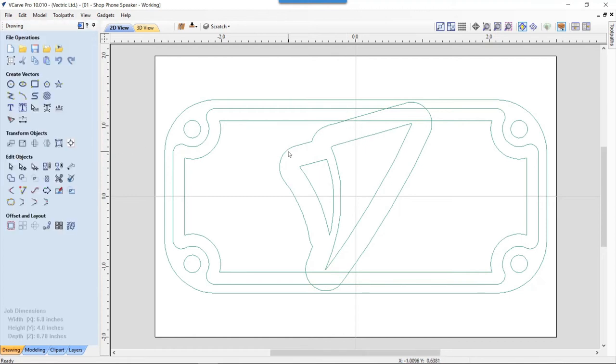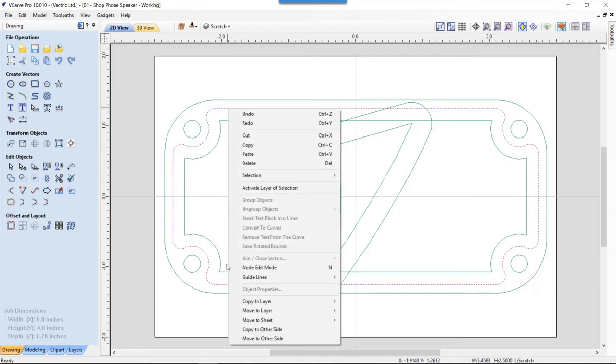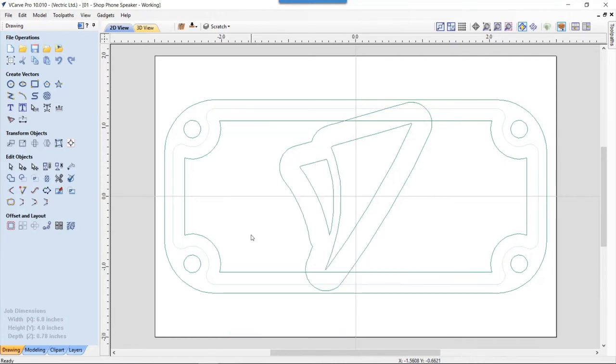Let's close that down. And before we go any further, I don't need this vector anymore. So I'm going to right-click on that and say move to the other side of the scratch layer, and I can use that now to pocket out the back side. And then we're going to take this vector and hold down my shift key and this vector, and we're going to use that subtract feature again, and that will give me the outside edges of my speaker reveals or my grill reveals. Select that. Again, we're going to do the old fillet thing again,